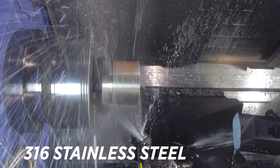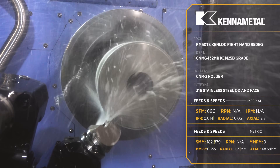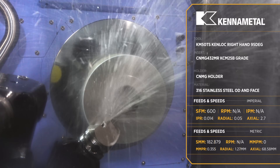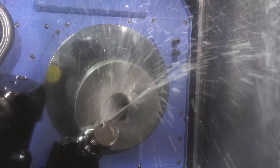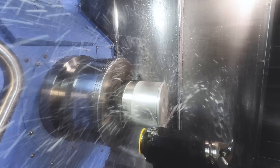I'm going to start off by facing the part and then we're going to turn across the OD. My depth of cut is 130 thousandths, but I'm not going to be using that for the OD pass — it's just going to hit it in one pass due to the final OD size of my part.